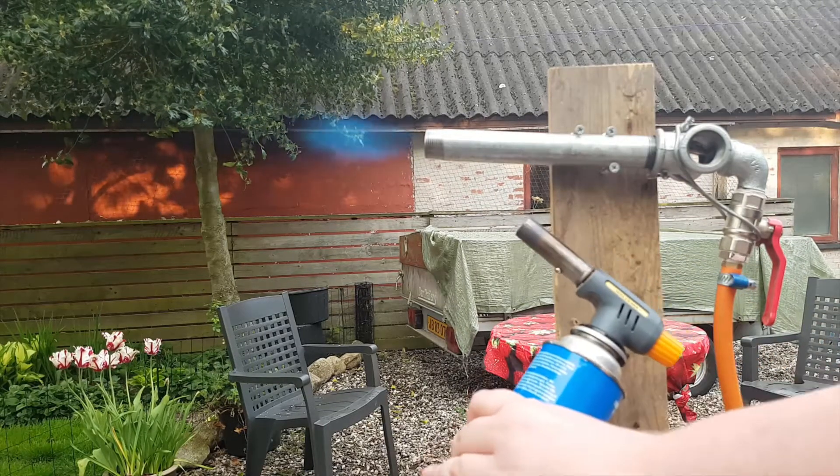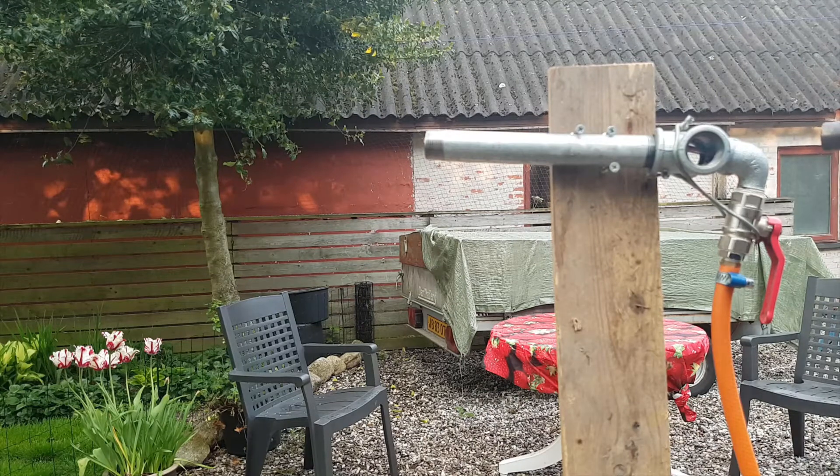So I tried lighting it with the air intake. However, the flame acted more like a pulsating flame, which would not be acceptable for a burner, mainly because of the heat loss within the tube. This occurs because the flames travel back and forward inside the tube. An example of this can be seen here. That's also the reason why it's so loud when it's running.